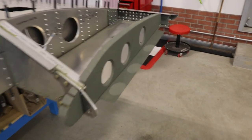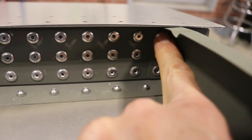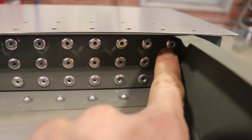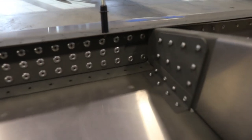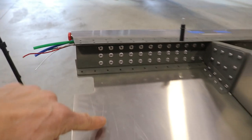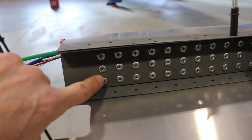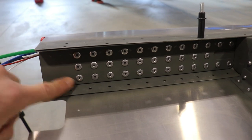Now for some examples of where I didn't think far enough ahead. There's a rib on the very inboard part of the wing whose back flange gets riveted with three large A6 rivets into a big stiffener plate. Before those three go in, the rib needs to be in place. But I was just happily riveting along and installed those three rivets without installing the rib first. So now I have to drill out those three rivets to put the rib in, then re-rivet with the flange behind them. If I'd thought ahead, I would have marked those holes and left them empty.